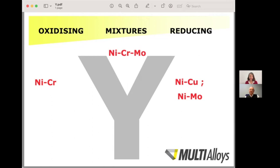And just on localized corrosion, last session, we spoke about stress corrosion cracking, applying to austenitic materials. And so it might be worthwhile mentioning that although nickel has an austenitic structure, the amount of nickel in the material is such that it renders the alloys immune to the classic chloride stress corrosion cracking that could affect the austenitic stainless steels. Okay, so that's a tick for the nickel products. Now, you mentioned earlier, and we can see from the wire diagram, we've spoken now quite extensively about the oxidizing scenarios. So let's move into the reducing environments, and I'm presuming that we're now not going to have chrome, but maybe other key alloying elements that we need to consider.